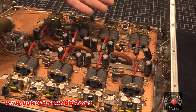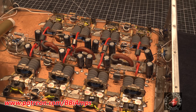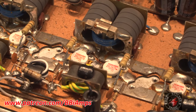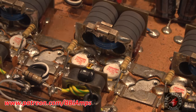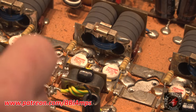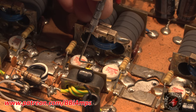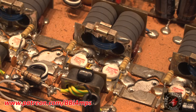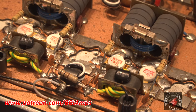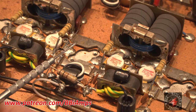And so they just slapped new pills in it, did really, really bad solder work. Like, now there's a bunch of solder flick that's all over on the inside of this box. This is a good example of it. So we have the dull solder. It's really dull. This is all the pre-existing solder work, then we have this nice new shiny piece of solder that's sitting right here. That's floating around inside this cabinet. You can see more of that evidence here. Let me unplug this real quick. We can see more evidence of that present here.